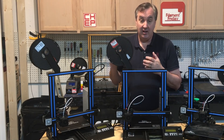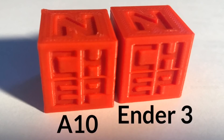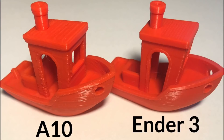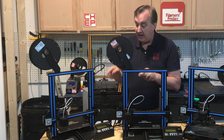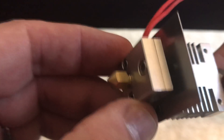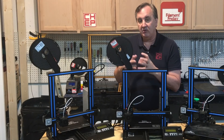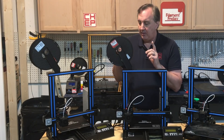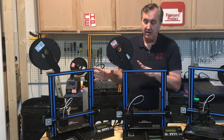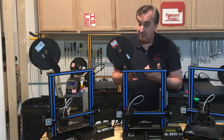That's the only real issue I have with this machine. Both machines have been printing a lot of small prints, big prints, and printing them really well — the quality I'm getting is fantastic. Not quite as good as my Ender 3 but close, because I'm using my Cura 4.4 profile tuned to the Ender 3. The hot ends are very similar — PTFE tube goes all the way down to the nozzle — but there's a slightly different cooling setup since the cooling fan is on the side and the fins are a different design, giving slightly different flow. I'll need to tweak the settings a bit for the A10s, but I'm getting about 90 to 95 percent the quality I get on my Ender 3.